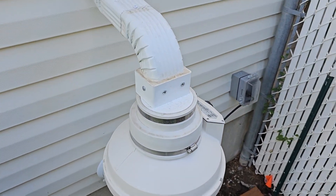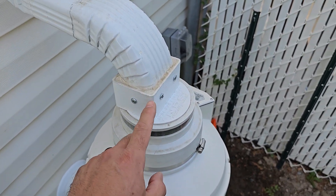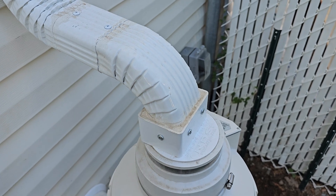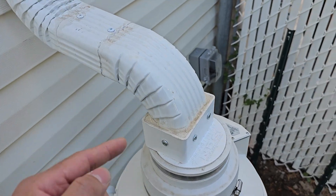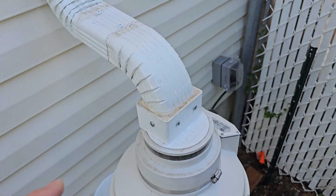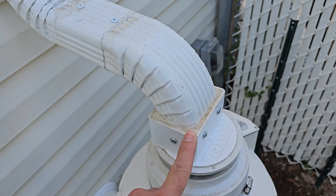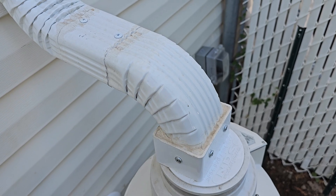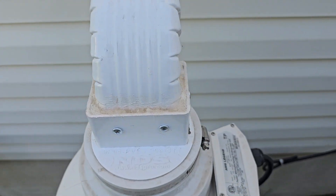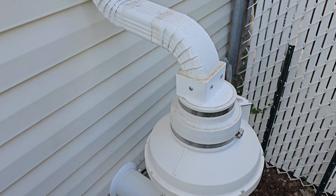One of the things I had a hard time figuring out was an adapter from a four-inch to a downspout. Online I did find later that there were some other options, but Home Depot and Lowe's only had something for drainage piping, so it was a really loose fit all the way around. It kind of worked — I ended up just screwing it in and caulking it all the way around to make that seal, and that's how I solved that problem.